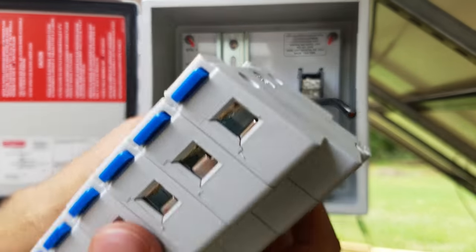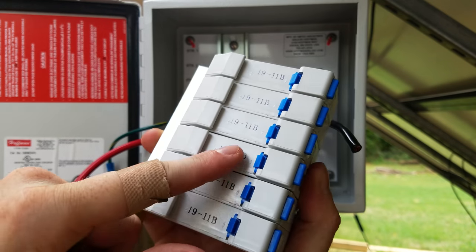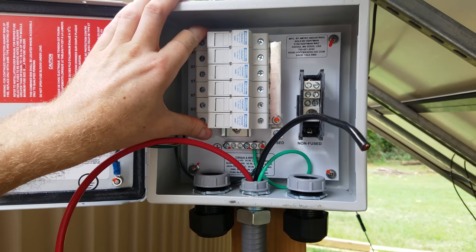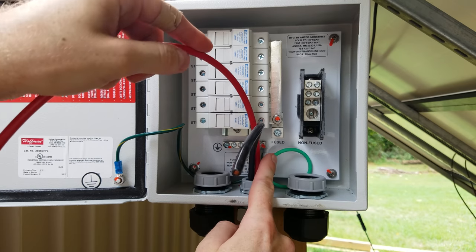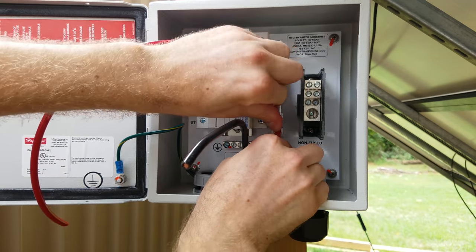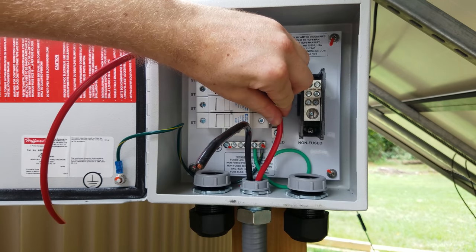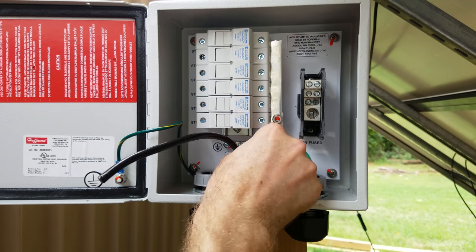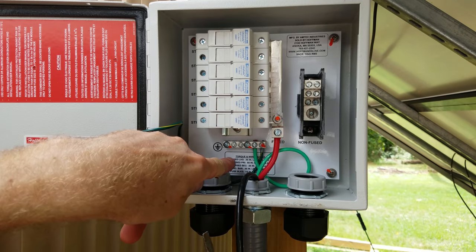This is the fuse block I had removed temporarily, so I'm going to put it back in. It uses a standard DIN rail — there are slots on the end which receive the DIN rail, and all six tabs clamp on and hold it into place. There's not a lot of room to work in here. I'm going to be running five pairs of PV cable through here, so I want to cut these as short as possible to avoid leaving a lot of slack. I estimate where the positive wire goes, cut it, strip about 3/8 of an inch, and push it under the terminal and tighten it down. Torque specs for each bolt are given on the bottom.